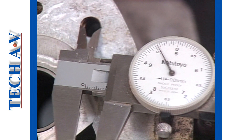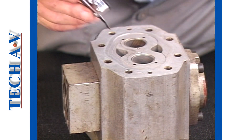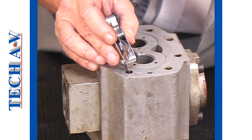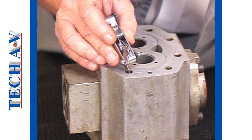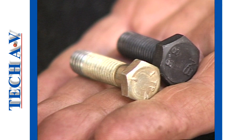We are not sure yet about the thread type, so let's move across to our thread chart, where we notice that a 10mm fastener size could possibly be M10 metric or 3/8 of an inch imperial. Trying to use our pitch gauge into such a small hole is not going to help us very much — we simply can't see. Our only alternative is to obtain some sample screws of metric M10 and 3/8-inch imperial threads, and physically try one at a time until we discover which thread fits.